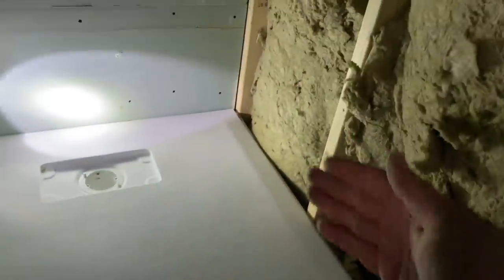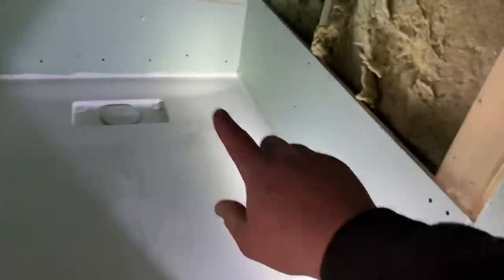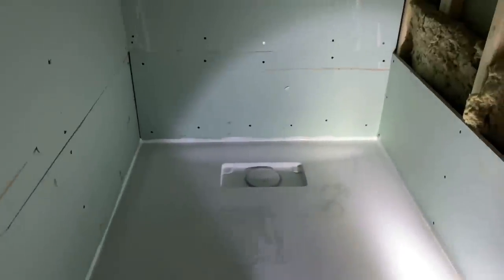So now we'll get this board back in and get it sealed up all the way around. There we go - I've siliconed it all in. Put loads in there because we're going to tile down there anyway, as normal. Tray's in, sealed in. Some people use Classy Seal - I just use silicone. If you want to use Classy Seal, carry on. Once it's tiled down to it and sealed again, it'll be perfect. Before they tile, they'll seal all the walls and everything like that.